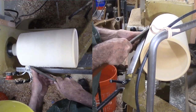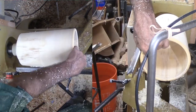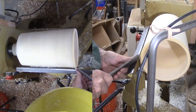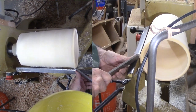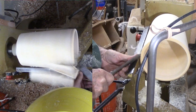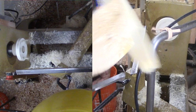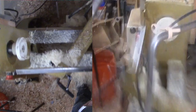I should have made a faceplate for the live center end because it developed a wobble, probably from the screws in the end grain in the aspen loosening. Either this additional faceplate or a steady rest would have helped. In any case, I got a catch, and that was a disaster. There was nothing I could do to salvage it as a lampshade, but I did not throw it away yet. After talking with Lauren at our club meeting, I decided to try to get something from this disaster. A little lemonade from my lemon.